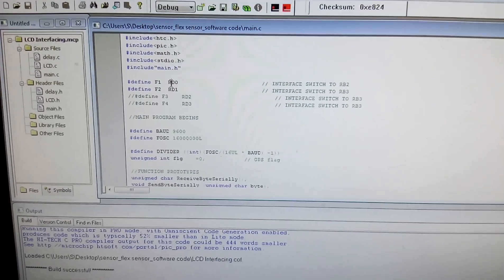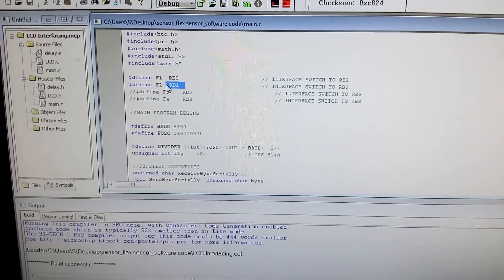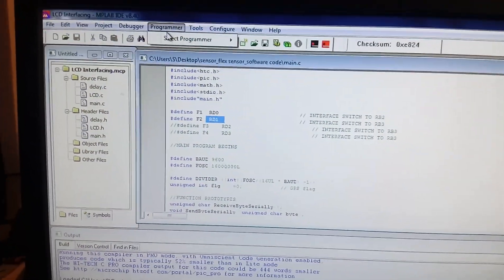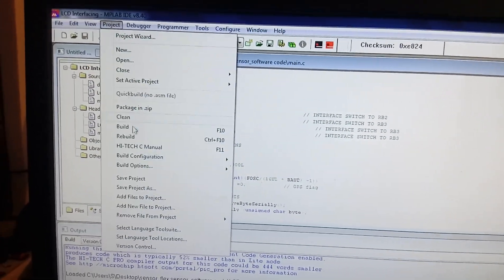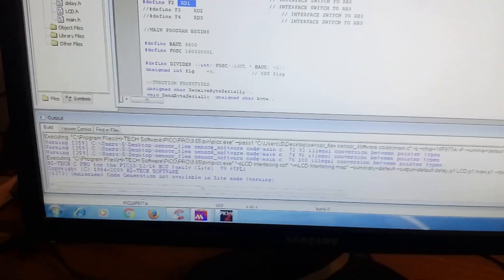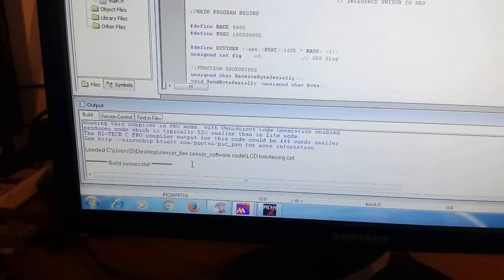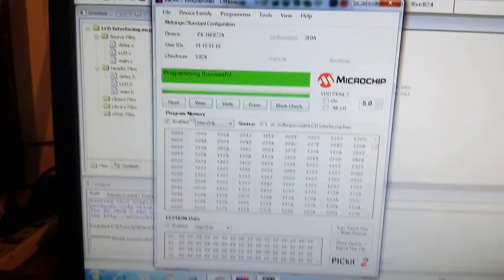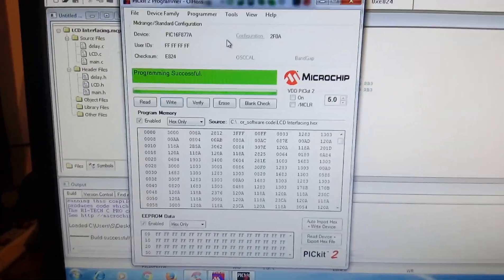I am using RD0 and RD1 pins. In the IDE, go to Programmer > Project > Rebuild All. Once the project is rebuilt it will say "Build Successful." Then you can select the device and dump the program.